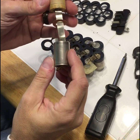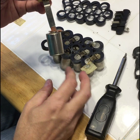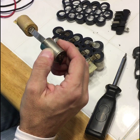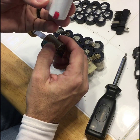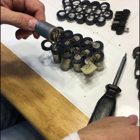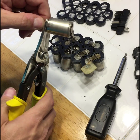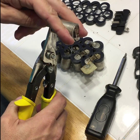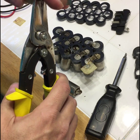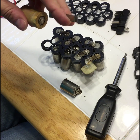This is the only one that has a long tab, and that's so that we can get from one side to the other. All the other ones are short tabs. So what I'm going to do is I've got small tabs already on the batteries, so I'm going to end up soldering that onto this long one. I do need this one long one, so I'm going to snip it because for whatever reason I can't get these off with the soldering iron. I'm going to snip that one and keep this tab to put back on later.